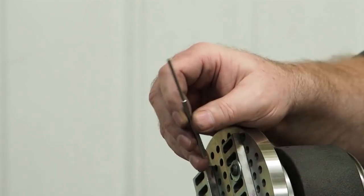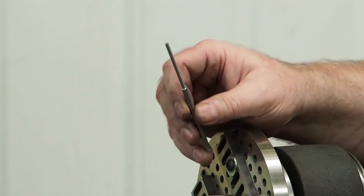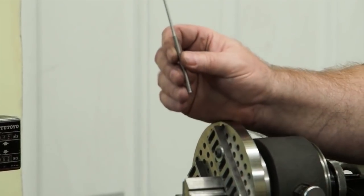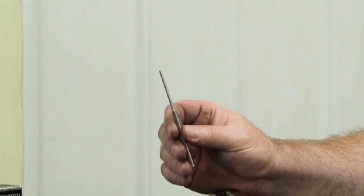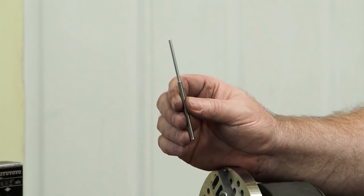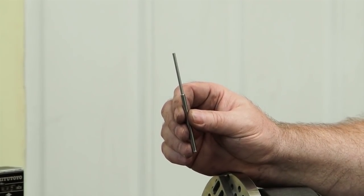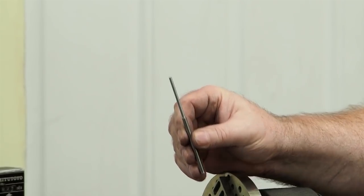And it's also because this wheel that we got from Radiac is really an awesome wheel. It blows me away at how free cutting this was. If this wheel wasn't as free cutting as it was, there's no way in the world I would have got away with what I just did right here. So that Radiac wheel is awesome for this small type work. And this goes back to the whole thing that I talked about before, that you want to pick the right wheel for the right job. Wheel selection is probably the number one important thing that you need to do.